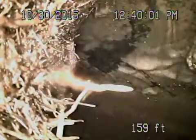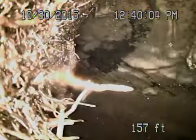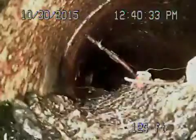This is the city connection. You can see there's a little bit of roots right at the end — these roots need to be cleaned. We've got some more roots here. That's the six-inch clay pipe we're in now. You can see some minor roots at the joints, which is very common in clay pipe. Overall, this pipe looks like it's in pretty fair condition, but it definitely needs to be cleaned.